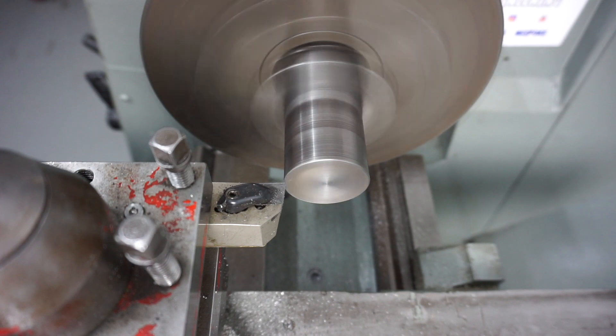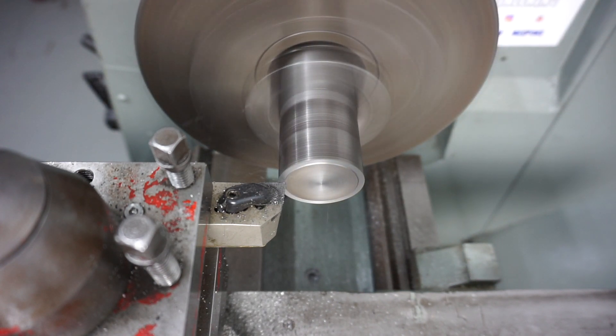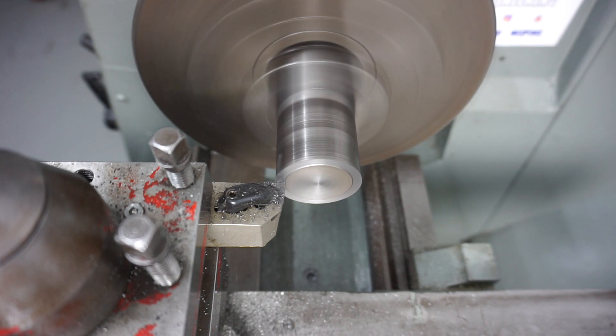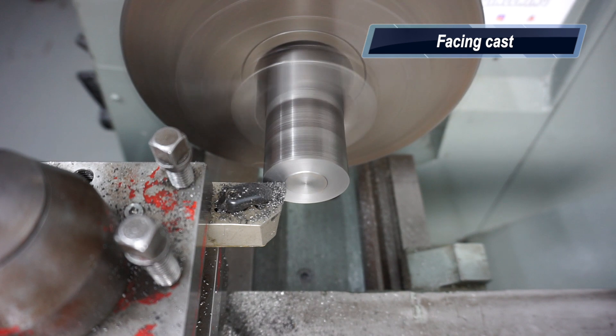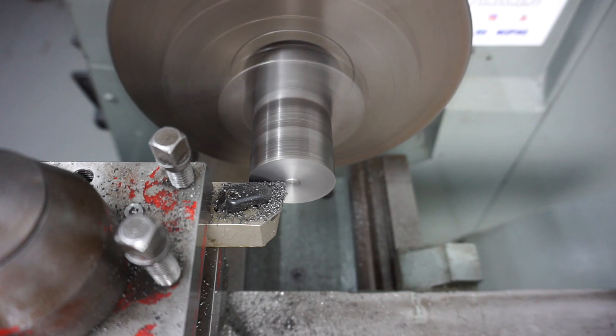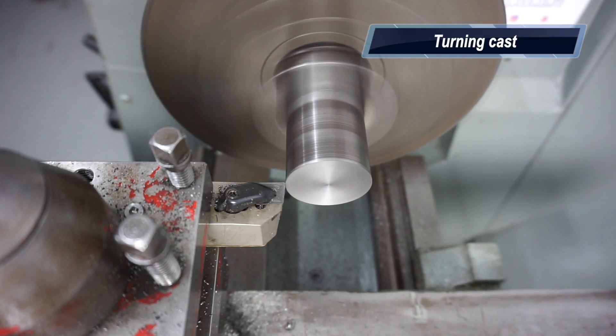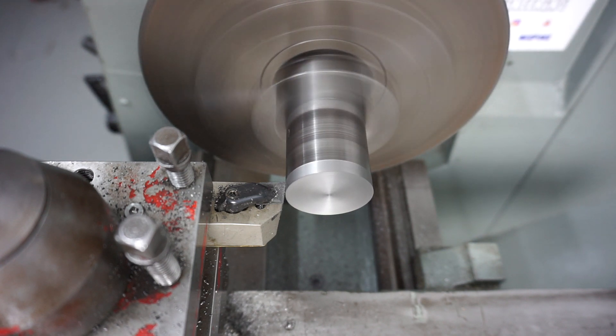To make the rings I just used a bit of cast iron I had — it was nearly on size for the diameter, I didn't have much to play with at all. So I had to come in there and face this cast, and once it was faced I could just lightly parallel turn it and take a very small light skim off that.